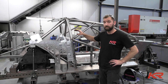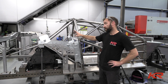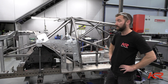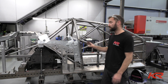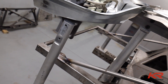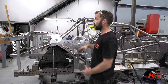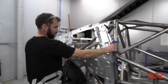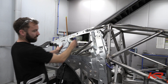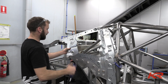I'm just starting to fit the C and B pillar as well as the parcel shelf for the Mustang. These are all OE parts that have come to us from DGR Team Penske - they've rough cut and marked out for us so we've got a bit of an idea on where everything goes, and from there we just fine tune and trim. In the rear with the parcel shelf section, we've got all the jigs from the machine shop so everything bolts together and clips on really well. As we go through, we can get everything where it's got to go. You can see the top part of the C pillar coming together - it starts to give us the shape of the Mustang itself.